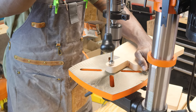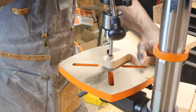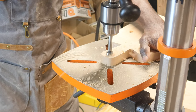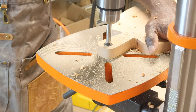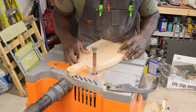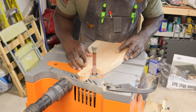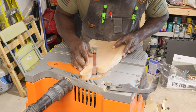Next it came time for the finger hole or the hanging hole — I'm not even sure what you call it. For my purposes I turned my drill press down as low as possible. A trick I picked up is: if you see chips then you have it at a decent speed; if you see sawdust then you're going too fast and you're probably also seeing smoke at that point.